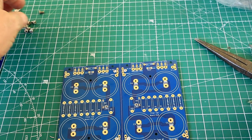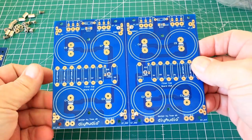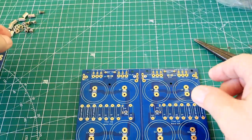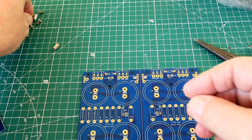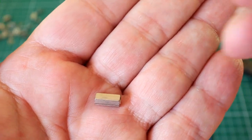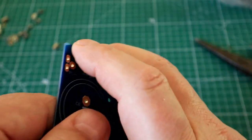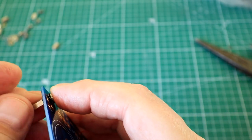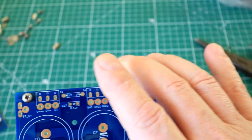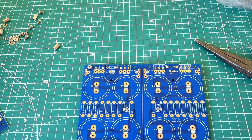I'm now going to put in some standoffs. I don't use a PCB clamp — I've always used my hands on the bench. I've got some 7mm standoffs and some little M3 screws, and I've got some washers and spring washers that I'll use — that'll hold it firm. I'll just go along and spin these on nice and tight, and that'll stand proud of the workbench whilst I'm working on it. I'll carry on and do that and we'll be back soon.